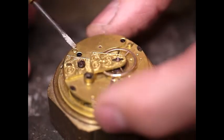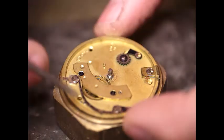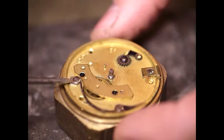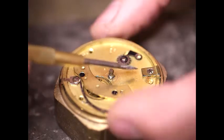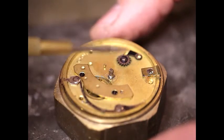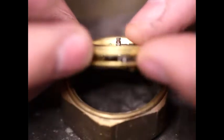It does look as if it's been properly pinned, so I don't think it's that. There are a couple of other things we need to look at. This particular watch does have a fusee chain, so this demo will feature removing that fusee chain. I'm going to take these pieces off here. This is the catch which attaches the watch into the case, and that's the hinge with a little pin in it which allows the movement to hinge onto the case. We're not going to take this off because there's a special technique for taking the fusee off without breaking it. The third wheel will probably come off when we do the fusee, which is a bit later on.